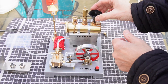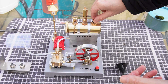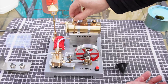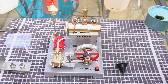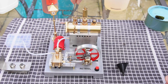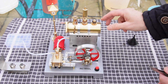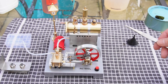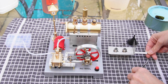I've put in about three quarters of water there in the boiler. One thing to bear in mind is this is all going to get very, very hot — this is a 14+ age rating. The control valve — the throttle — is very nicely made in brass, and the whistle is pure brass, but it will get very hot to the touch. They do provide you with a pair of tweezers for helping with construction, and these will come in really handy for regulating the steam. The boiler is going to get very hot too. We've oiled it, we've got preheated water in the boiler, we've got the exhaust running into a little plastic box that came with the parts. I think it's now time to light the burners and wait for it to build up steam.